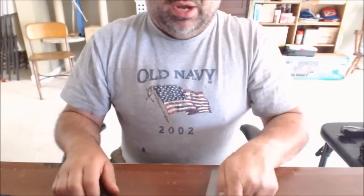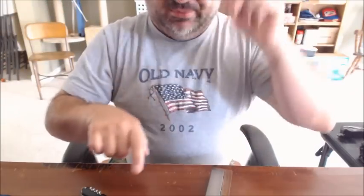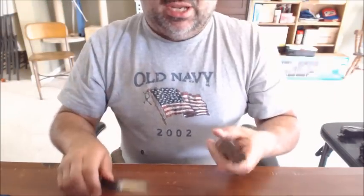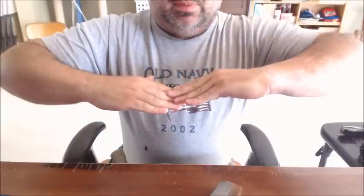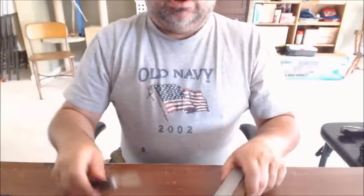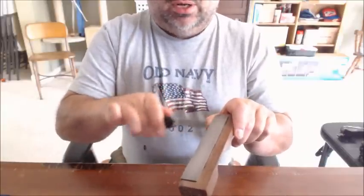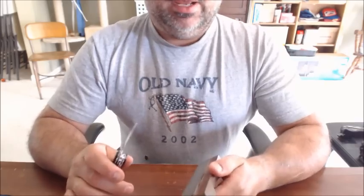A rolled edge looks more like the bow of a boat hull. It's what you classically find in Japanese swords — not a true sharp flat edge, but rounded to a point and back out again. That edge is a reinforced edge. It's very hard to do by hand; most people use a slack belt, where a sanding belt bows in the middle under pressure giving you that perfect curvature and a sharp point. Doing it by hand you're doing angle after angle, trying to figure it out.